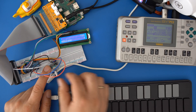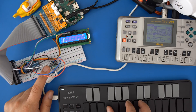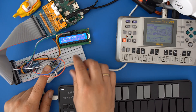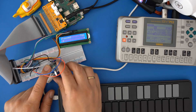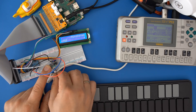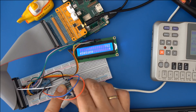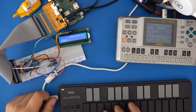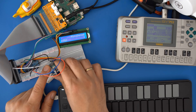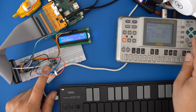This string sound has a low volume and is panned hard left, layered on another string sound panned hard right for a nice fat chorus effect. The reverb send is maxed out, and this pad is also slightly detuned for a fuller sound. Both left and right pad sounds are listening on MIDI channel one, so both can be played on the keyboard simultaneously. The second tone generator has the same patch but panned hard right and with less detuning — it's on the same MIDI channel as the first part, leading to a nice stereo sound. On the third tone generator I've selected the DX7 slap bass, listening on MIDI channel 2.